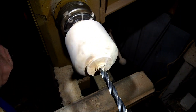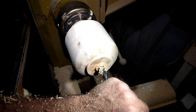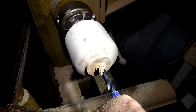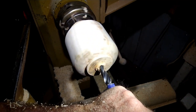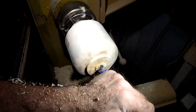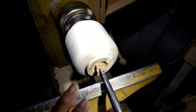Okay, what I've got here is a chuck with a drill bit in it. I'm going to drill to the depth — I've got it marked here — and that's going to be my depth for hollowing. I've got my speed turned way down. I like to use just a regular drill bit because it doesn't have a point on it. If you use a forstner bit, it has a point on it and you have to allow for that down in the bottom. This works best for me — that way I don't have a point in the bottom and I can really smooth it out once I get down in there. That's all we do — just drill it.